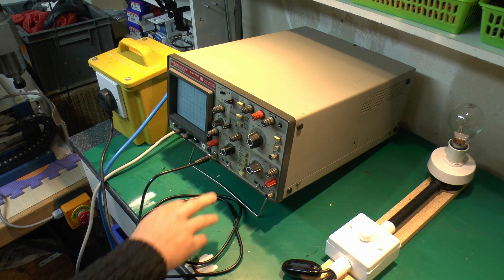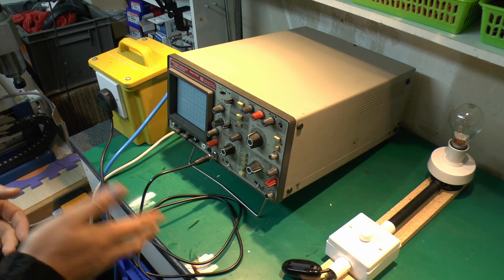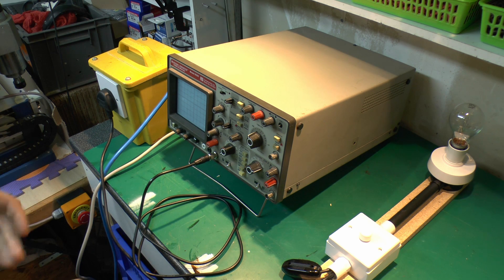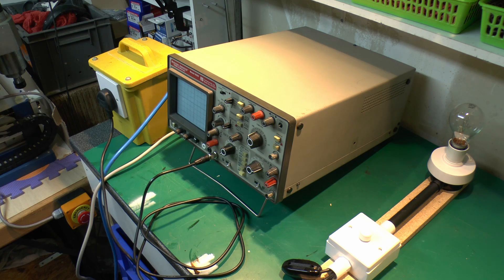The reason for this is that the oscilloscope front input can theoretically deal with 400 volt peak maximum, but the settings on this one only go up to 5 volts per division, and with 8 divisions that only means 40 volts would fill the screen. So though in theory you could put 400 volts in, it wouldn't fit on screen. The divider divides by 10, giving more sensible measurements. Also consider that the UK mains at 230-240V represents a peak voltage of about 340V, plus there are often transients and spikes which can be vastly more, and could easily damage the oscilloscope.